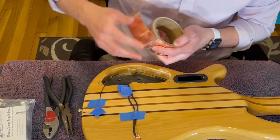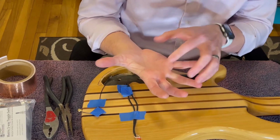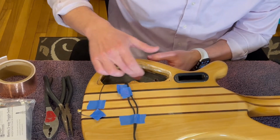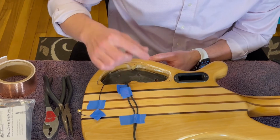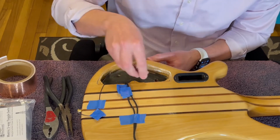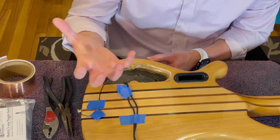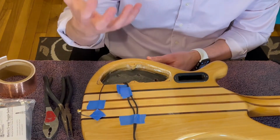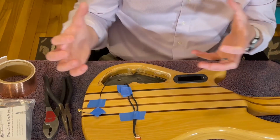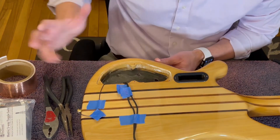But if you line the cavity with this and create essentially a cage, kind of a cradle, and you put everything else in here, the last key is taking a ground wire. If you connect the metallic surface to the same ground that the whole rest of the electronics are on, you are creating what is known in electrical engineering circles as a Faraday cage. And that really just helps to electrically block much of the interference that could be coming in here. So it's super easy to do.